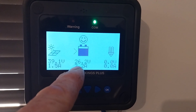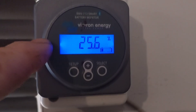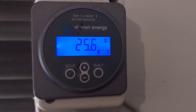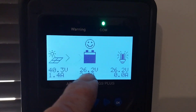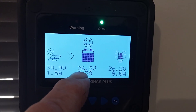But that's a voltage based meter, so it's registering voltage and determining state of charge on voltage. Now if we go over to the shunt — this is the shunt here — you can see that the actual state of charge of my batteries is 25%. So there's only 25% left on my batteries, yet the voltmeter battery monitor is saying that there's about 80%.